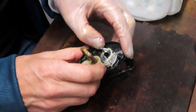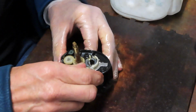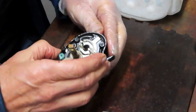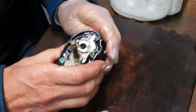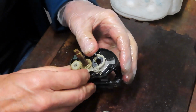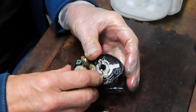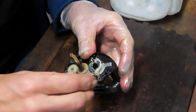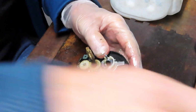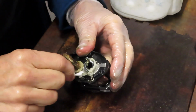And you just want to make sure what's going to happen is this click rotor is going to come and push this back up, and that's going to reset the bar, and then you're going to push it down again, and it's going to reset the bar, etc. So if you just do this a couple of times, that will work out whatever's left. I don't see any dirt, but whatever dirt is left, it will certainly work it out. And then once you're satisfied that you've got it all, just feeling a little bit more grit there. There we go. Now we got it nice and clean.